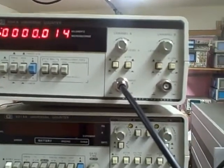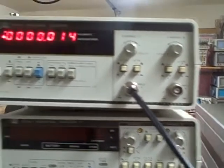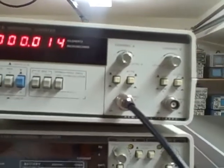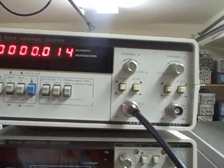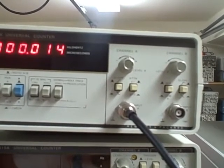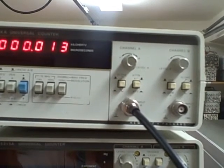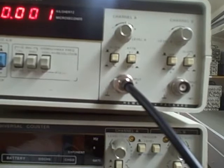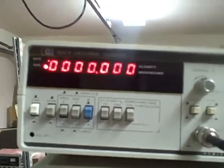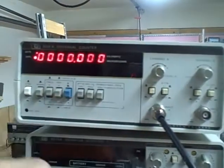So this is Friday — it's a day later, been approximately 20 hours since last we were here, and the unit has been warming up the whole time. This time I have the Rubidium frequency standard in lock right now, and we see that we are about 14 Hz out. I'm going to try and adjust that down. There we go — we've got that adjusted now to exactly 10 MHz to the third decimal point on here.